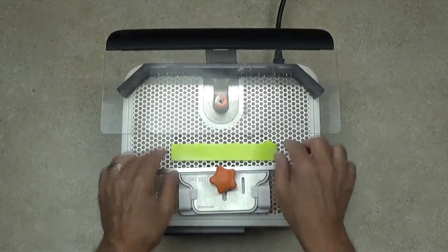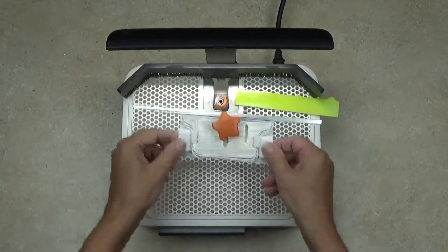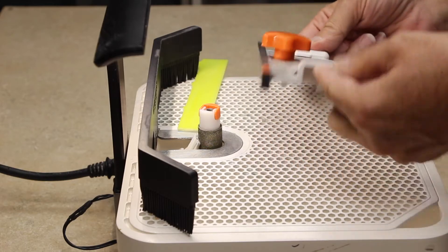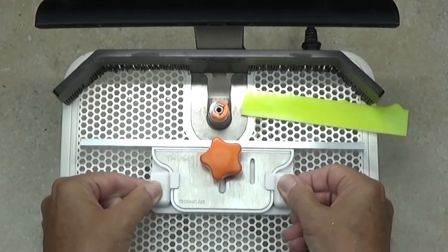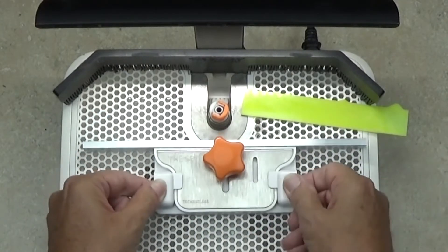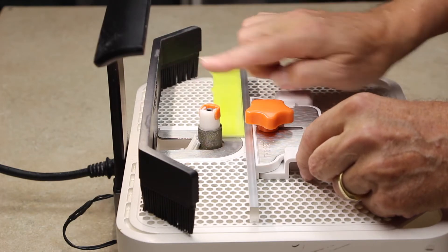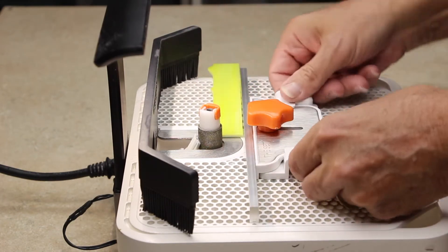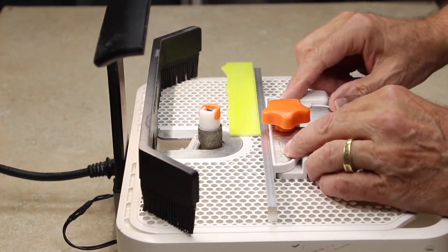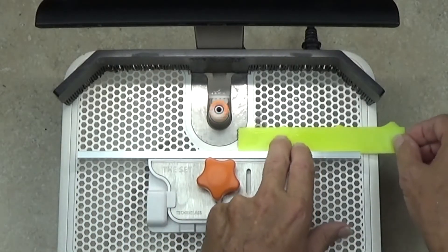I'm going to remove the face shield just to make it easier to see on this video. So we have our piece of glass and we have The Set. Those four little points go into the correct holes on the tabletop, and these finger notches make it really easy to pick it up and put it back down. Let's position it — and as with the other one, it will only go in if it's completely square to the grinder bit, just like this. Now it's square and it lines up with the grinder bit, but it's way too close — the glass will not fit in — so I have to lift it off and move it back a couple notches. Now I have plenty of room for the adjustment. Loosen the knob, push it forward until it's exactly positioned where I need it. Tighten the knob and here we go — once again feeding it in from right to left.